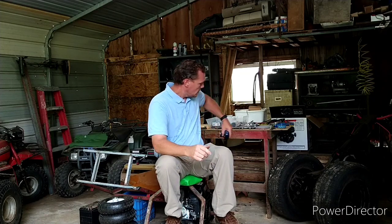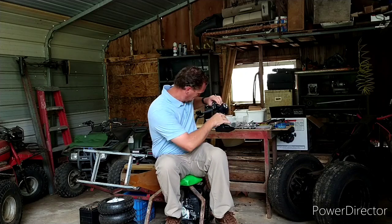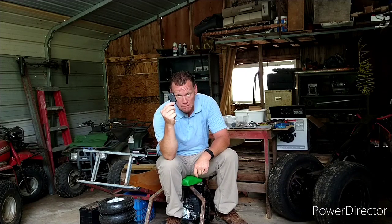So we've got a lot of fabricating to do and some electrical stuff to do. Check it out — all the other radio controlled stuff I've built, I've worked with a controller like this. But you're going out on the beach, you don't want to have that big old controller. So I'm going to run everything off of this key fob, maybe two key fobs. This one controls two linear actuators, which means I can use one channel to control a linear actuator to steer, and the other channel to turn the motor on and off through a relay. Or I can add another one that only works one actuator and maybe make the umbrella attached to the wagon go up and down by itself. The sky's the limit.